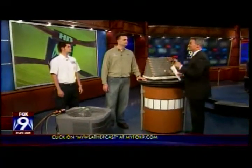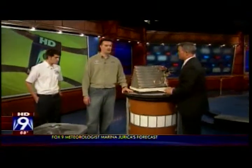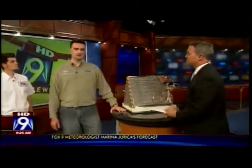Thanks for coming in — I think I've heard a lot of squeaky fans around the neighborhoods. What should we be doing right now, even if we have turned it on? What should we be looking for if we go outside, as far as the homeowner goes? Well, for homeowners, one of the easiest things you can do to make sure the air conditioning is running tip-top: make sure your furnace filter is nice and clean. You should change it out about every six to eight weeks.